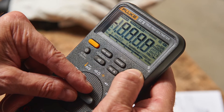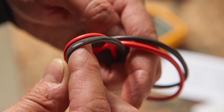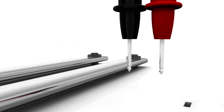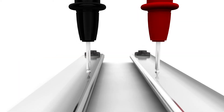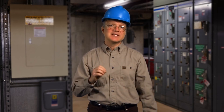Check your manual to see if the ohms and continuity circuit is protected at the same level as volts. If the protection level is not listed, ask for written confirmation from the manufacturer. Step 5: Examine your test leads for such features as finger guards and CAT ratings, and look for frayed or broken wires. Check the length of exposed metal and make sure the tips are the appropriate length, such as 4 mm for CAT-3 and CAT-4 environments. Test probes are designed for a variety of test environments — what is appropriate for a printed circuit board in a CAT-2 environment may not be appropriate for 480 or 600 volt circuits. In a high energy setting like CAT-3 or CAT-4, be sure your test probes have a minimum amount of exposed metal. Shorter test probe tips reduce the amount of exposed metal when working in tight spaces, helping eliminate the chance of a phase-to-phase or phase-to-ground short. It is good practice to consider replacing your test leads and probes annually if they receive heavy use. Test leads and probes are your first line of defense for making safe electrical measurements.